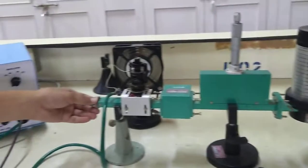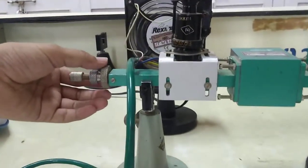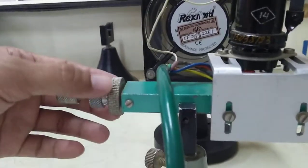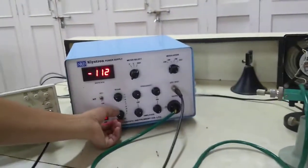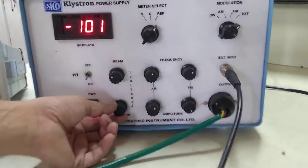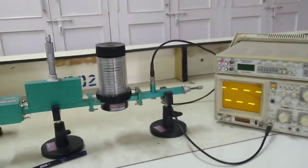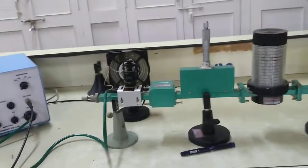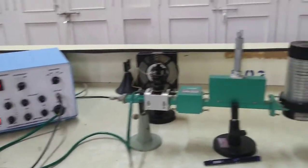As mentioned at the start, there are two options to change the frequency of this reflex klystron oscillator. One is by changing the cavity dimensions by varying this plunger — this is called mechanical tuning. The other option is to vary the repeller voltage, and if you vary the repeller voltage the output frequency will also change — this is called the electronic tuning range. All of these characteristics — the VI characteristic and the power versus frequency relationship of the reflex klystron oscillator — we will see in our upcoming video. Thanks for watching, that is all for this video.